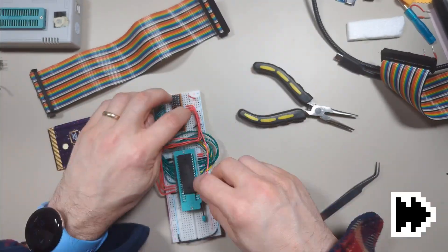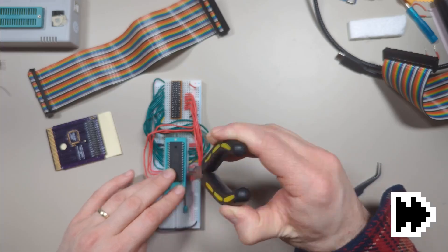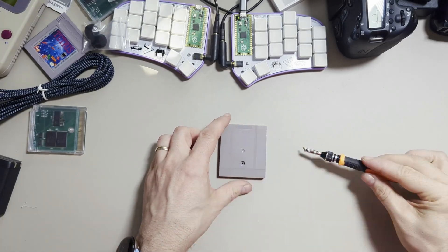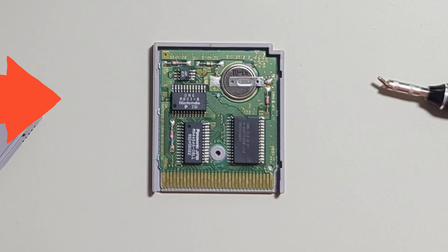But the ABC has an extra trick up its sleeve. When I made a flash cart on this channel it was only usable for ROMs that are 32k or less. That's because I hooked the memory chip directly up to the cartridge connectors, and the Game Boy can only directly access 32 kilobytes of data from a cartridge's ROM. Bigger games get around that limitation with a technique called memory banking, which essentially splits a larger ROM into banks and lets you switch which bank is being accessed at a given time. This comes at the cost of extra circuitry, though. In original Game Boy cartridges it's done using a specially made chip called a Memory Bank Controller, or MBC.